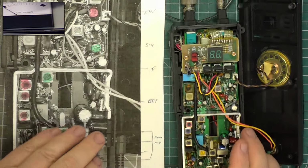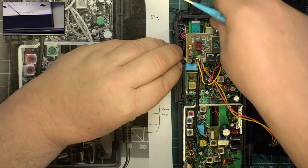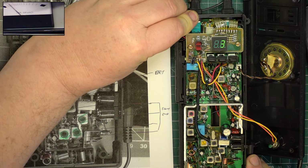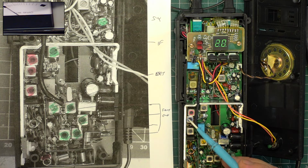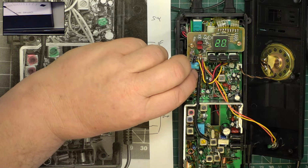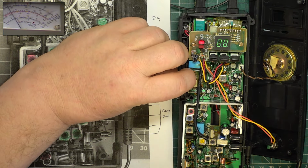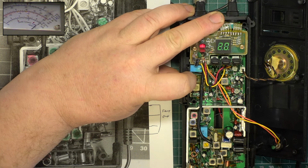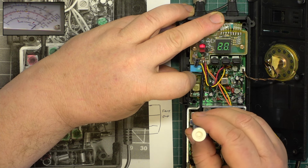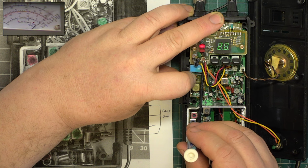But now put onto a photo I've just done, like we've been doing recently. Shall we have it that way on? I think we'll have it that way on. Right, power back on. Of course, you've got to remember these things start up on channel 9, which is annoying. There we go. So going to transmit, and I'm going to go down these three and see what we get. So picture in picture on camera one. We're in low power again. Is it that one? Yep. So we're on the 2.5 watt scale. Transmit, we're at 1.06 amps at the moment.